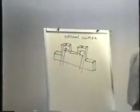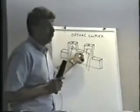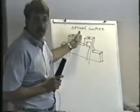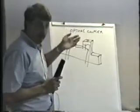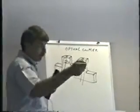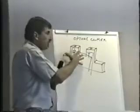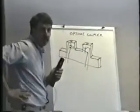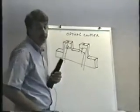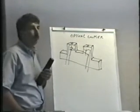This is a really cool deal, and I'm going to pass it around. We use these in pinball machines — in Williams pinball machines — to tell if a drop target's down. The drop target puts a little piece of plastic between there and blocks the beam. When these things fail, the drop targets don't work. When they fail, the LED burns out. Just take your sensor card, hold it in there — if it's glowing red, the optical coupler's okay; if it's not glowing, the optical coupler's bad or the connections are bad.